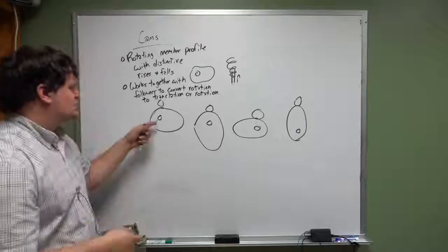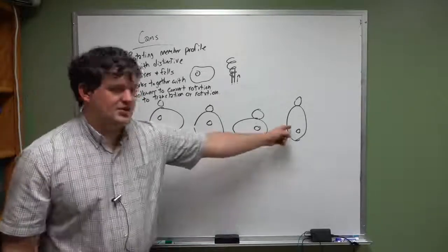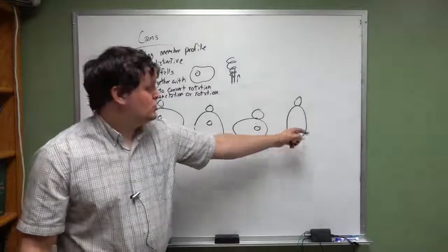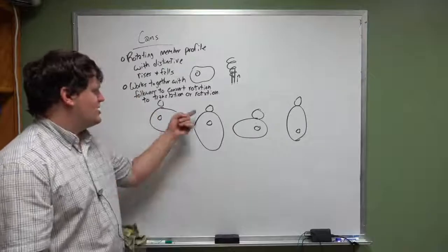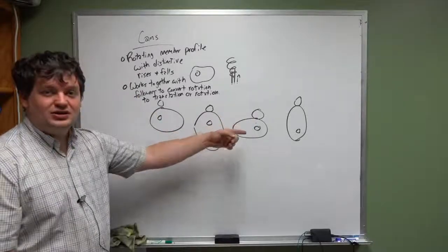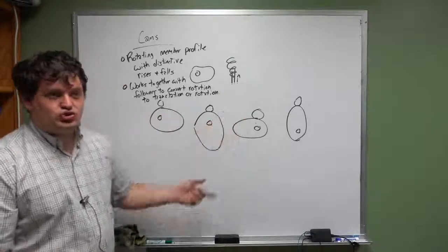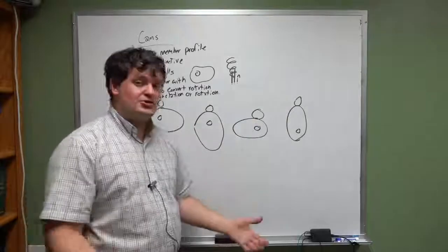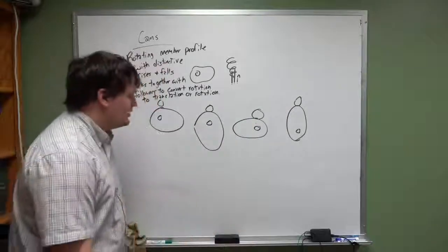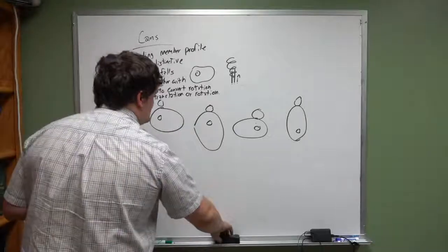Okay, if you have a certain amount of power that's going into this, your power is going to be most substantially used when you're actually moving your follower. It's not going to do anything when your follower is not moving. All the power that you're plugging into the system between here and here goes straight into heat. And here, it actually goes into mechanical power transfer. Okay? So that is ultimately what a cam is.